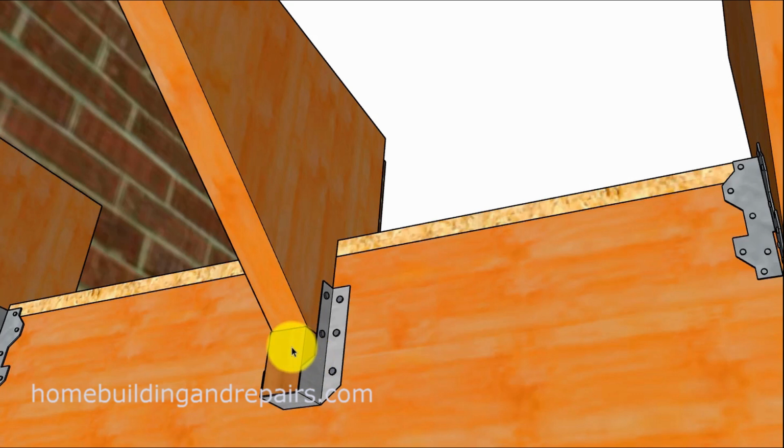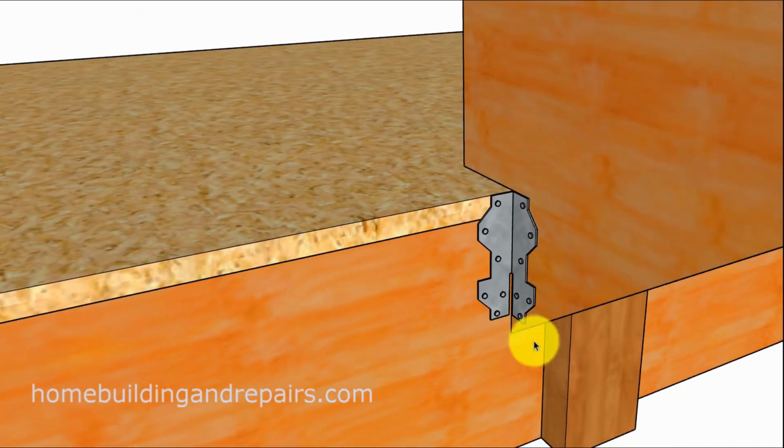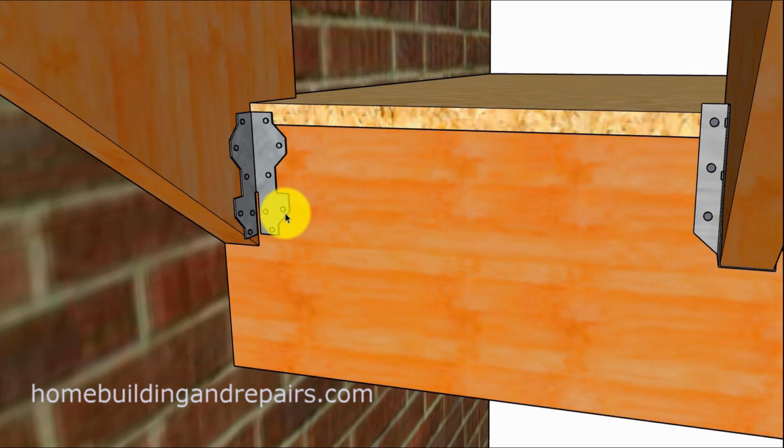You would take the block and then maybe put a couple of screws or some nails, nail it into the beam and maybe into the hanger also. But something like this would just be an alternative for a problem you'd run into if the hanger was going to be sticking up too high above the sheathing, and you might only get one nail into it. So that might be an alternative, just kind of throwing something else out there. And some type of framing anchors to attach to the side for this. I don't know if that would satisfy the inspector, but again, just throwing it out there.